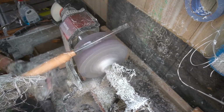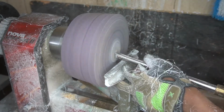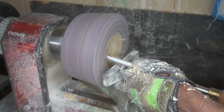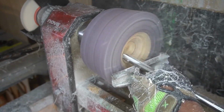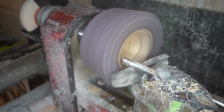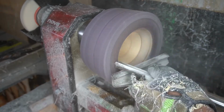Everything's nice, neat, and even. You can see there I'm resting the chisel on top of the blank itself. So everything's going pretty smooth. So here we are. Now we're just doing the gouging part. This went relatively smooth. The waste block took up a lot of sections of the bowl, so it was a lot easier to get in with the chisel and get everything nice and even. Had the waste block pretty much turned without any kind of real difficulty up into this point.